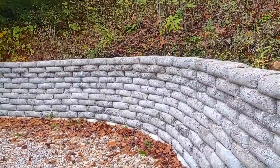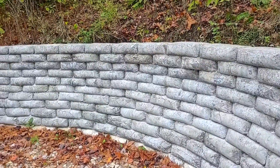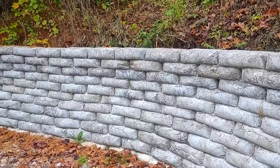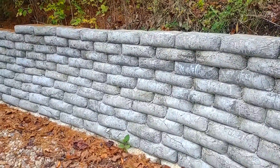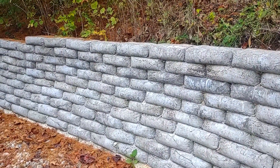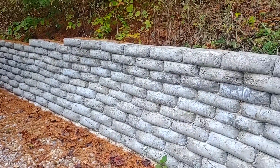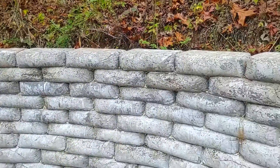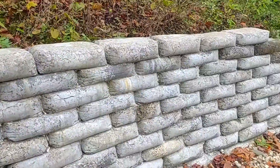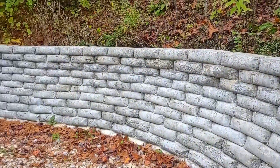You can tell it's kind of rough-textured where they weren't mixed — I learned my lesson. This was a rush job. I also didn't fill any of these cracks and let it go through two freeze cycles — two winters with rain, freezing rain — just to see what would happen, and it didn't seem to crack or crumble. When you don't tape the bags, they stretch and form cracks as they set up, so I suggest you tape the bags and go back and put some more concrete texture on the face of it.